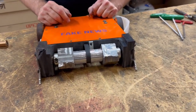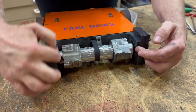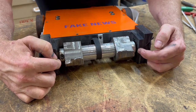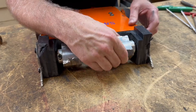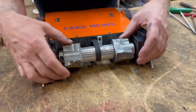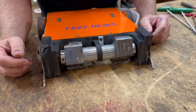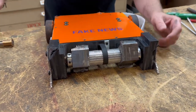One of the biggest problems I had was where the shaft interfaced with the bushings. I wasn't taking into account how hot some of that was going to get, and it actually melted the plastic and just started melting away the frame there. And so, believe it or not, even with all that slop, this still spun all the way through the rest of the event. But clearly, this is something that wouldn't work for down the road.